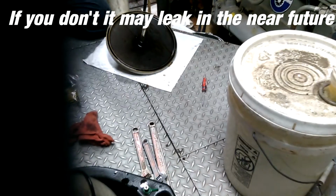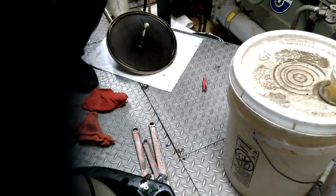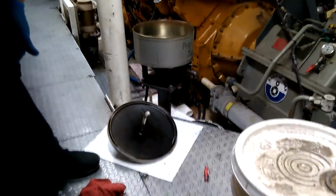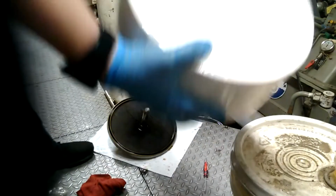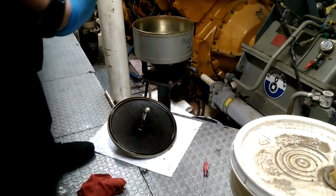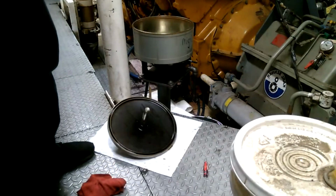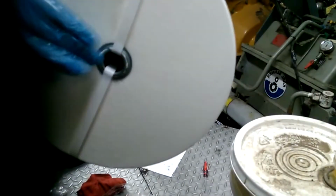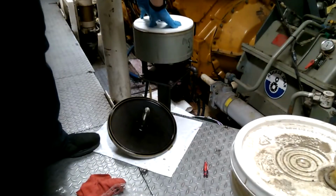And with that done, we will now move on to putting in the new filter. Take out the green plastic bag that is normally shoved into the filter, and always install it with the metal ring up. That way the bolt O-ring has something to seat to and seal.